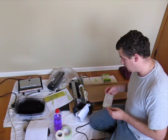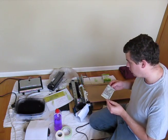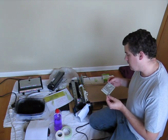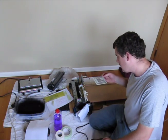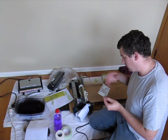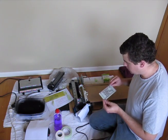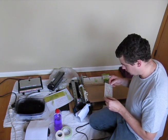When you're printing the board it's important to keep it warm when it's going through the printer. It means the ink doesn't flow around so much, and it also means that the board stays extremely dry. When the toner goes on you don't want there to be any moisture or humidity on the board, because it stops you from blowing away the excess toner — and if you can't blow away the toner you can't bake it and etch it. So it's really good to keep it warm both when you're doing the circuit side and also when you're doing the silk screen, as it keeps the ink in place.